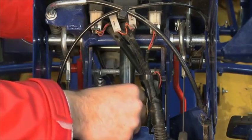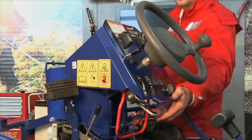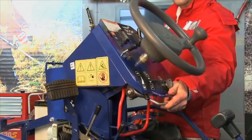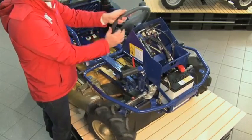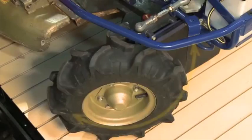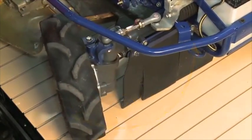This is a very capable four wheel drive all terrain mower that has European certifications for grades up to 25 degrees, with stability angles of 30 degrees left or right. The Razorback has a rack and pinion steering box, is able to withstand side impacts, and has a steering angle of 75 degrees in each direction.